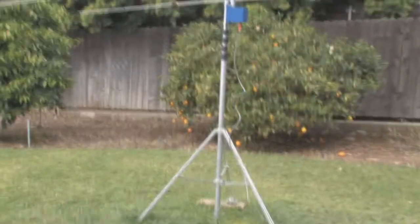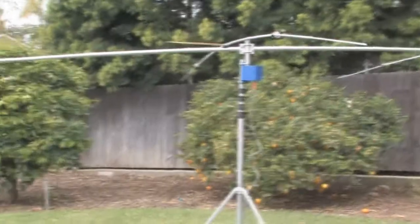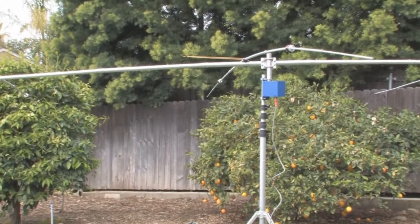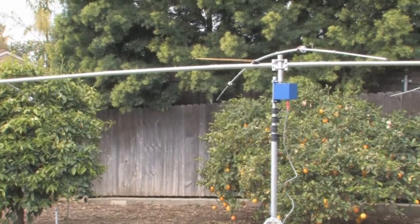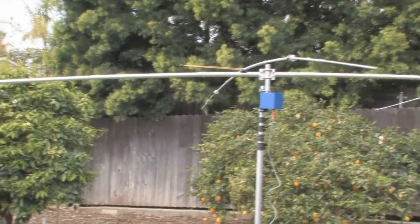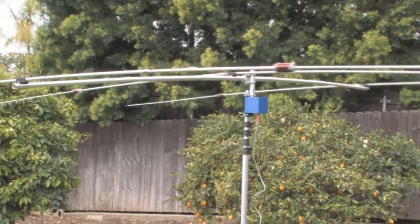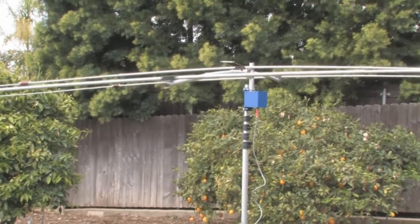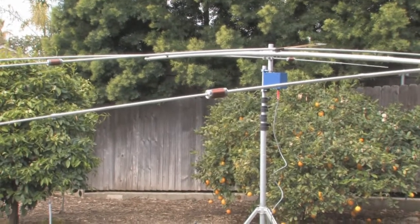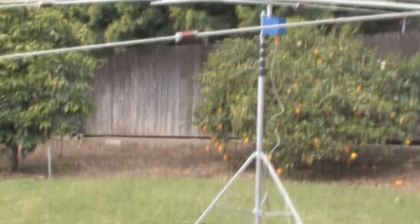So I press the buttons. You can see how well it's able to turn this full-size Super Antenna at its full size. Now it's not a full-size 20-meter Yagi, but you get an idea of how well this thing actually does work. Turning it back the other direction — there's a really significantly sized gear reduction motor in this thing obviously. You can see it does swing a little bit as I let go; there's not a brake in it, but it does work pretty good.